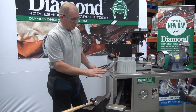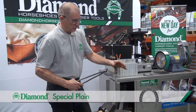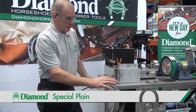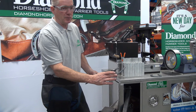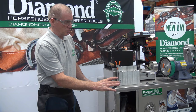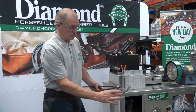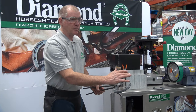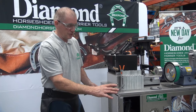I've taken the shoe to the hoof. This is a diamond special shoe — it has a wider width of web for this flatter foot. I need to round up the front of the shoe. Any shaping we do, we start at the toe, move to the toe quarters, the quarters, and then finally the heels. Get your toe between first nail and first nail hole adjusted before moving back, then go on to shape the rest of your shoe.